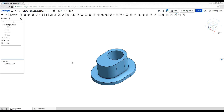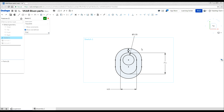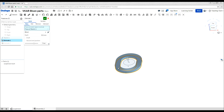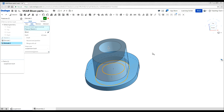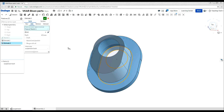Here is the finished part I ended up with after designing in Onshape. It's only got 3 features that make it up. First, we had a sketch, and if we spin that around, you can see there's not even that many measurements. I had used vernier calipers to size up the original bushing, and then I drew it all on one flat sketch. After that, I did two extrudes — the first to do the outer base, the part that sticks out to help it locate, and then secondly, I extruded the rest up to a height of 4.5mm. I did iterate several times; I had a version that was above 5mm, but it was sticking out a little bit too far and I couldn't get the nut on far enough. So 4.5mm is what I settled on.